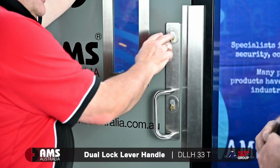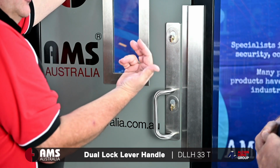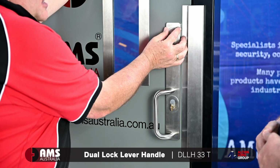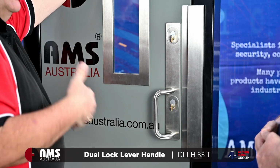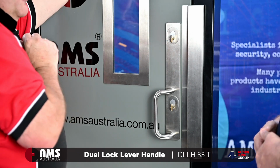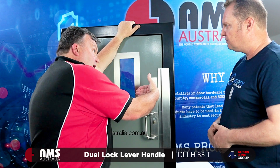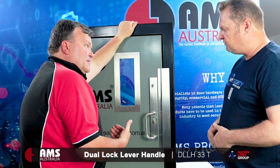There are two screws on the inside of that door furniture. You can undo the two screws and this escutcheon will slide up and down, 5mm up and 5mm down. So in real terms, you can accommodate anybody who hasn't fitted the locks absolutely perfectly. We've got an adjustable inside handle and an adjustable escutcheon on the outside as well. It's very clever, the whole thing.